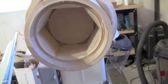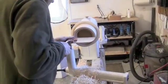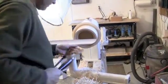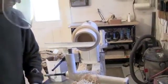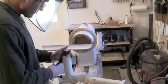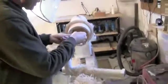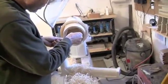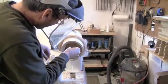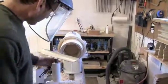And if you look inside here, you can see that it's still rough. And you can still see those stave pieces. So let's just go and turn it. Now I've got a great surface for gluing. Next thing I'm going to do is check my diameter. So I've got these calipers, and I want to check the inner diameter here, and I want it to be exactly those calipers, that diameter. So it starts out that way, but then it gets too thick in there.